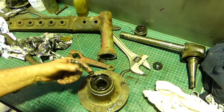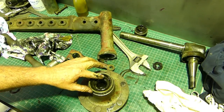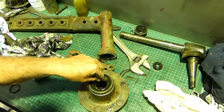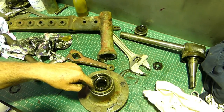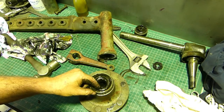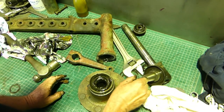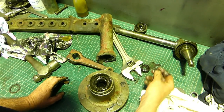There are a couple of different lines of thought - I've seen people put them one way to keep the grease in. Some of the new seals are double lip so you have one going in to keep the grease in. The idea of having one going in is if your seal has a spring on it, the spring is not going to rust away. With the double lip the outer lip keeps all the rubbish out.